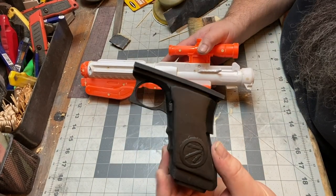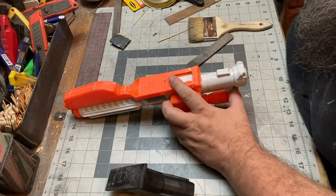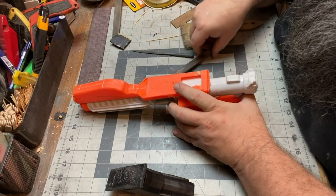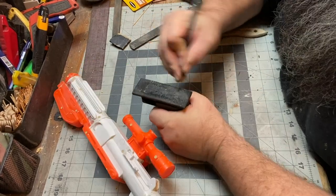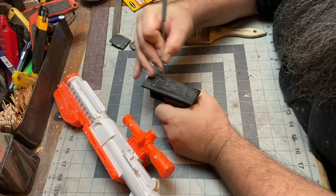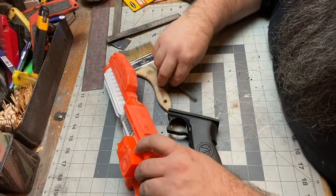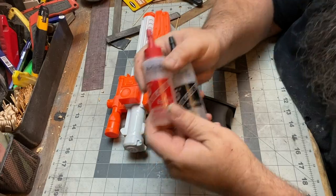And now it's time for the marriage. We're gonna mash together, my favorite thing, two things that were not meant to be together to make a new thing. So what I'm doing here is, because I'm gonna epoxy this and we don't want it to snap off, we want a firm grip. What I'm doing is I'm just toothing this up. I'm making grooves and channels for the glue to seep into and lock, right? You don't wanna go smooth surface to smooth surface, because it'll just eventually click off. So here I have plenty of little random grooves and cracks and crevices for the glue to sneak in, hook under, and you get a more positive grip.